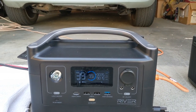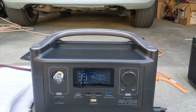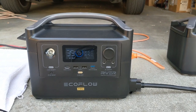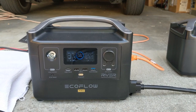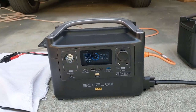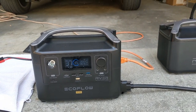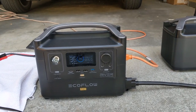Normally it runs at about 130 watts. I think because the battery is charged up to almost 100%, that's why the solar panel wattage is down to only 35 right now. Towards the tail end of charging, even from AC, it started bouncing down from 600 to 400, 300, 200, eventually down to almost nothing. So I guess that's why it's reading so little right now.